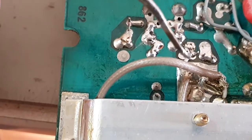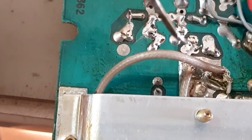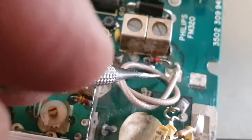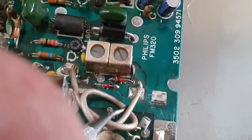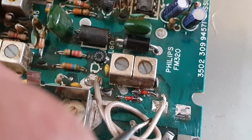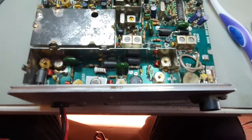You have to remove this RF lead from this point right here, lift it, and resolder it. Flip the board — let's just pull this out of the way — there's the quarter wave. So they're both done. I haven't cleaned that surface yet but I've put solder dabs on the positive side to the board to make sure it's a good connection.